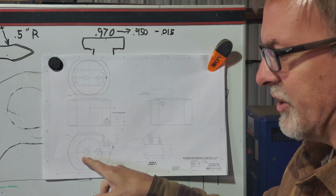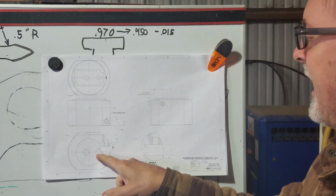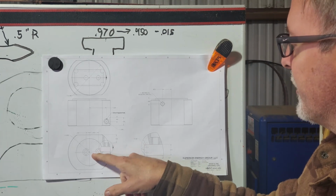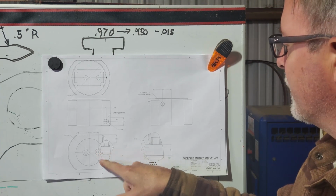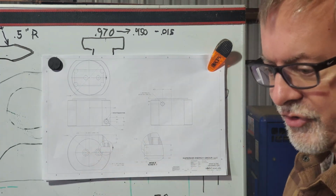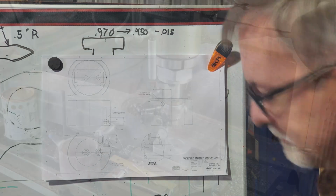And the counterbores, like I said before, is where the K&T shines. I'll just take a 1/2 inch end mill, offset it, and this is a 5/8 diameter counterbore, so I'll need a 1/16 inch offset of the head, plunge down the 1/2 inch depth, and then walk a 360-degree circle, and presto, I have a counterbored hole for a socket head cap screw.